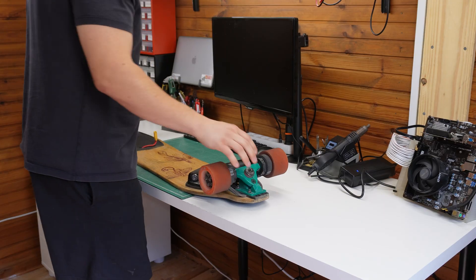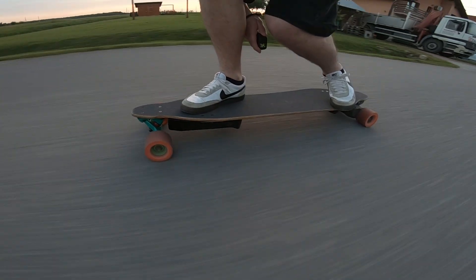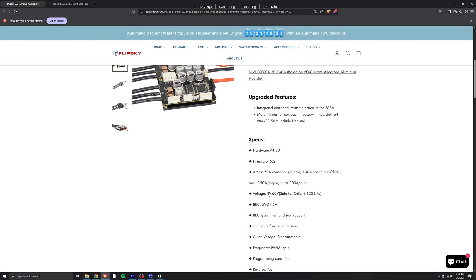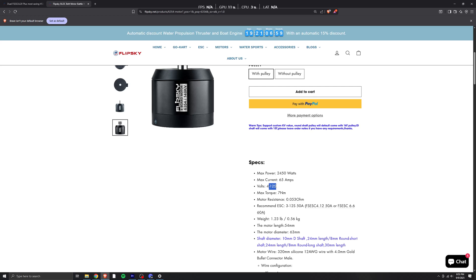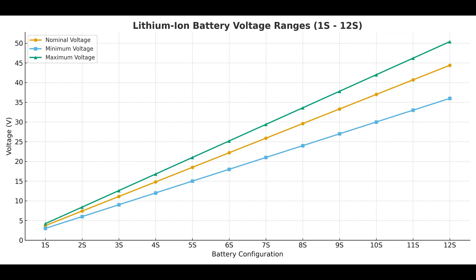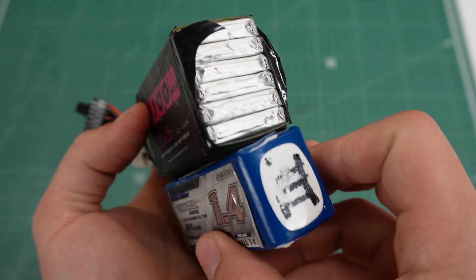Let's take a look at my case. I will be powering my electric skateboard, and here we have two crucial components: the brushless motors and the main speed controller, which takes input from a handheld remote and spins the wheels. The first thing to look into is definitely the voltage - the input voltage of my controller goes up to 60V. The maximum voltage of my motors comes to 12S, which simply means how many cells are connected together in series inside a battery pack. A series connection adds the voltage, so this number will help us calculate the maximum input voltage of my motors.